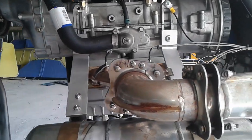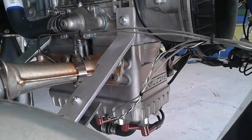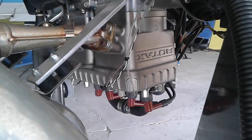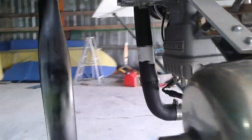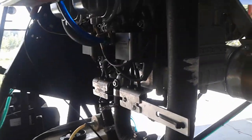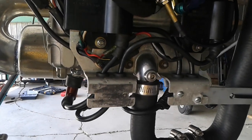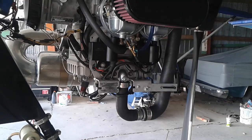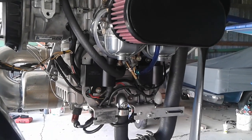As long as you're willing to warm up your engine adequately, the grey head is every bit as good as a blue head — some say even a little bit better. If the thermostat fails, they normally fail sort of half shut, half open. If the thermostat fails on a grey head, you still get half of your coolant going through your radiator and it will continue to cool the engine. With the blue head, up to 90% of the coolant bypasses the radiator if the thermostat fails half-closed, so you immediately begin to overheat and need to put it down into a field to avoid engine damage.